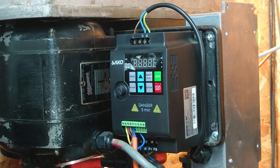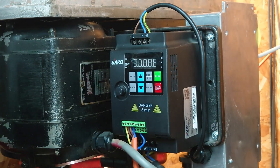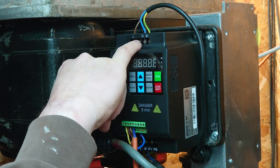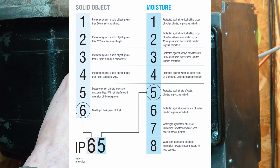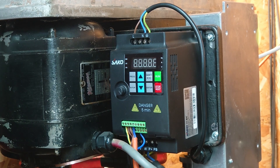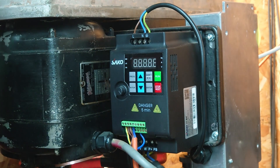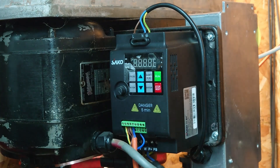I could buy a metal box and put it in there, then put holes in it and a fan to keep it cool because it's going to get hot. But I just don't think that's necessary. This slot is 8mm. Now IP2X from the ingress protection scale — the aperture has to be less than 12.5mm or half an inch so you can't get your finger in there. This is 8mm so it's technically IP2. You could say that's probably sufficient, but if I tried really hard I could probably just about get a finger on one of those terminals. So quick and dirty, I can shove a grommet in the hole and then there is no access to those contacts, and I can do the same down here.